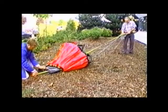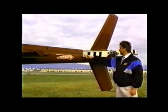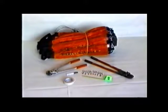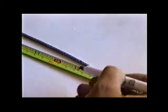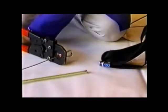If the overall length of the Bambi exceeds the distance from the cargo hook to the front tip of the tail rotor of the helicopter, the suspension lines must be shortened. The following example procedure reduces overall length by 19 inches or 483 millimeters. However, the overall length reduced should be adjusted for your specific overall length requirement for your particular helicopter.